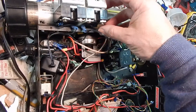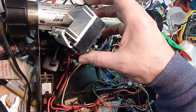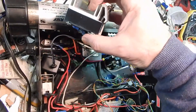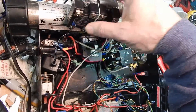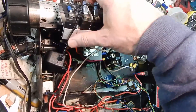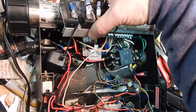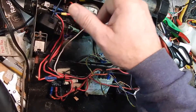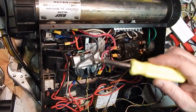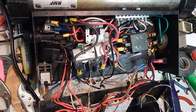What a pain. I also ended up changing out the relay heatsink I had planned for a more conventional one — it's probably a little bit under what I need. That's why I have these clamps kind of rigged to give me a little more area. I'm also going to try to use the bottom of the heatsink bolted right onto the chassis to put a little bit of heat into the chassis. That 12-volt power supply is just going to turn these on. Heavy new wires — all replaced. Pretty much done with everything now.